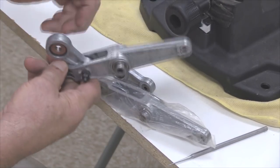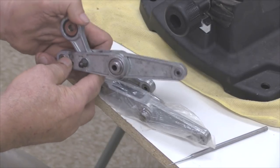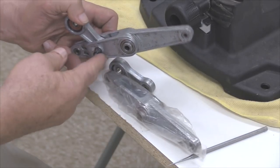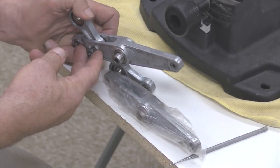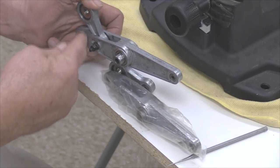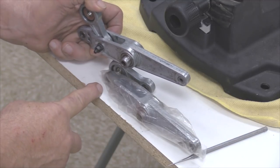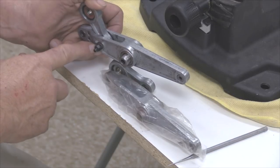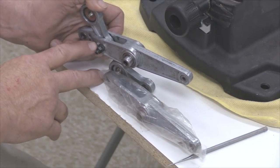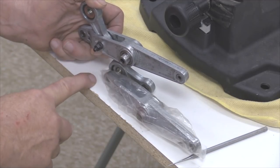Which by well, what I mean is you put your bolt through like this one is done. There are knurled washers on each side to keep the hardware from turning. Then usually what I like to do is double nut the threaded side of that. And I also, just for good measure, I put blue Loctite on there and lock that whole thing down.